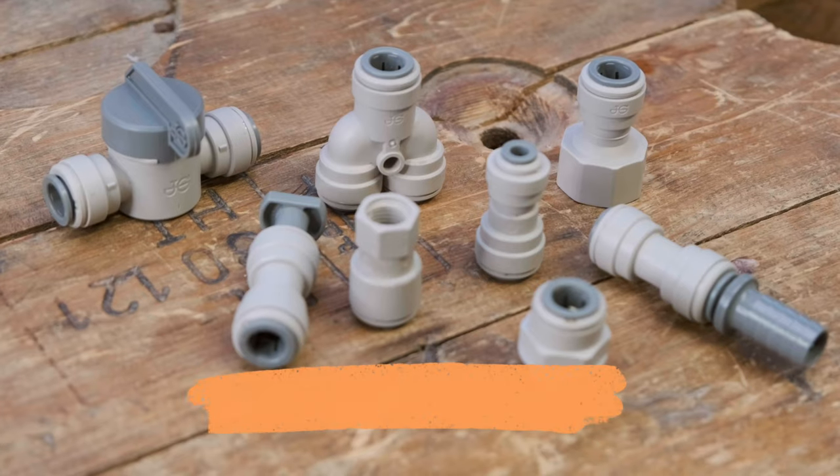And then the last one, which can be really complex but also massively versatile, is John Guest. You can connect one tube to another tube with a simple plastic push fit John Guest fitting — they are absolutely awesome, fantastic mainly for dispense. That's a really versatile way of connecting because there's so many different connectors available within the John Guest range: branches, splitters, you can change the size, so you've almost got an infinite amount of connections available.